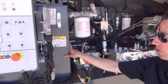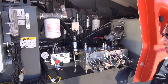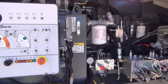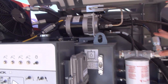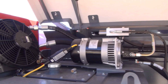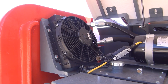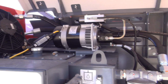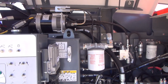Beside the brake manifold is the steel hydraulic tank — the exact same tank used on our 61 and 66T. Steel is very durable and also helps dissipate heat better. On top of the hydraulic tank, there is an optional 3.5 kilowatt generator as well as a hydraulic oil cooler. We actually have three separate generator options: the 3.5 kilowatt option, a 12 kilowatt welder-ready option, and a 12 kilowatt option that comes with the welder itself.